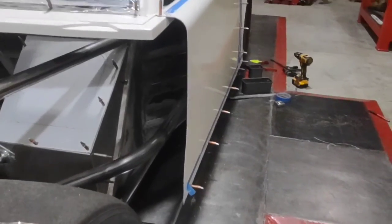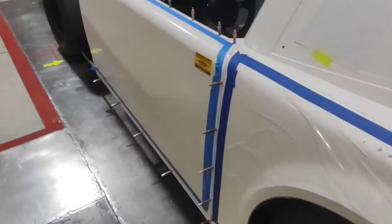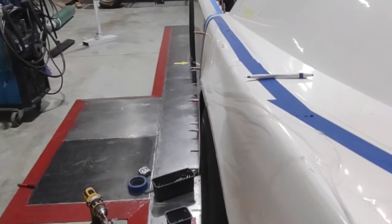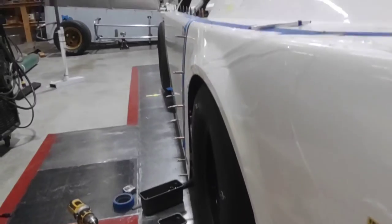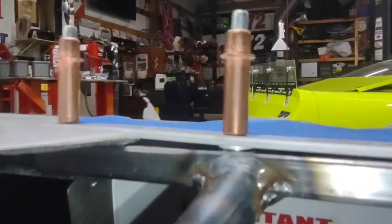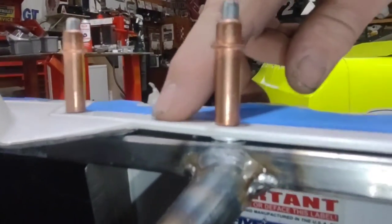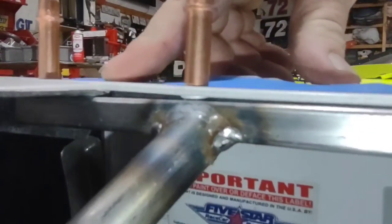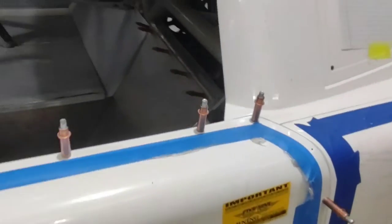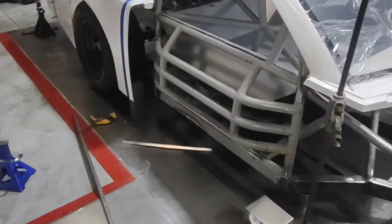The door is on there, clecoed on three of its four edges — we've just got to do the fender. I'm not going to rivet it down yet, but you can see the contour of that door and how it looks good against the rear tire. A couple of simple little hacks here: inside that rivet I did put a washer as a shim, because this fiberglass piece — I didn't want to trim it off as it's a lot of strength, but I also didn't want to see a huge dent start to form. Sneaking a washer down inside really helps shim that up. You will never see any elevation difference from there to there, but you will see that dent form if you're not careful.